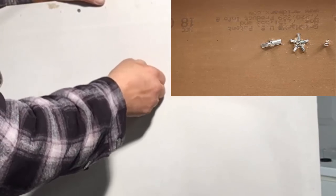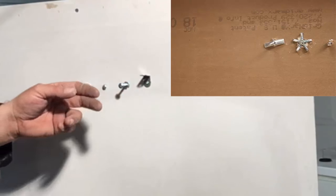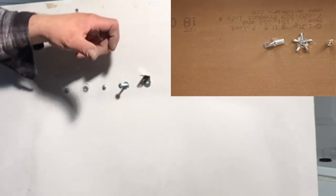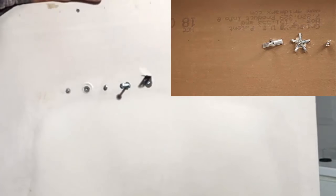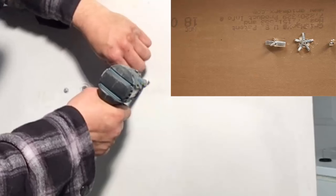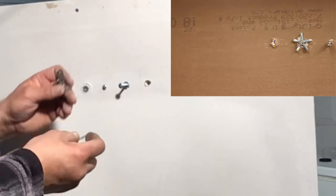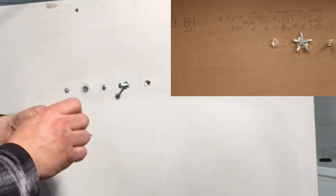Unfortunately, as I said, you have to put it through the item you're going to mount. If you're mounting shelf bracket standards with four of them, you have to get them all started in the hole — it's a little difficult. They hold really well though. When you take the item apart, the wing nut is gone behind the wall and you'll have to get another wing nut to remount. This one is not reusable when you remove your item from the wall.